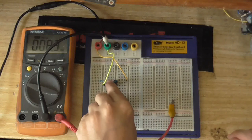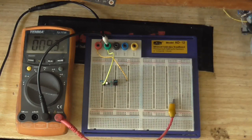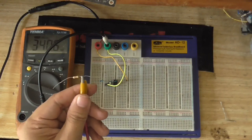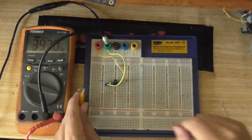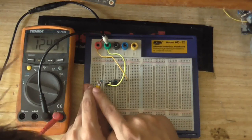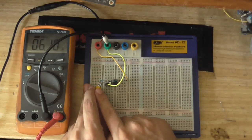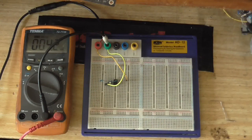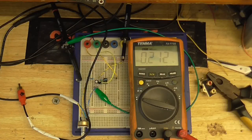So that also means we should have 6 volts at the non-inverting input. I'll just use the end of this resistor as a probe to measure the voltage — it should be right here. And yep, about 6.1 volts. That's just about where we need it. Let's see what kind of amplification we get.